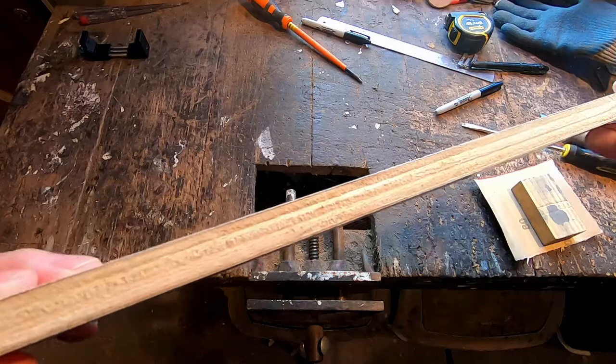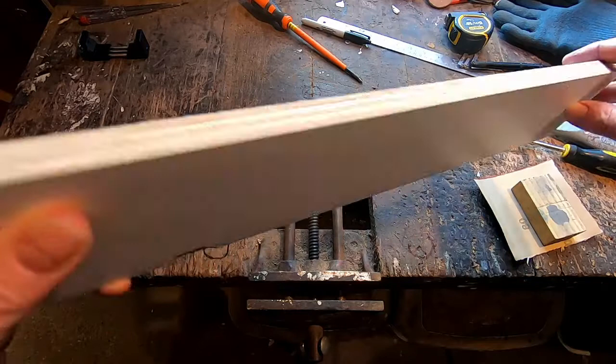This is an off-cut of the Morland furniture board — it's laminated on both sides and I've cut it with a jigsaw. As you can see, there are plenty of fibres sticking up, so the first job is to prepare it so that the glue can have the best chance of sticking.